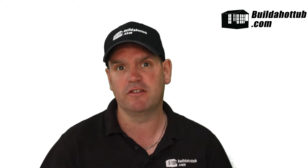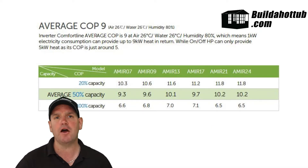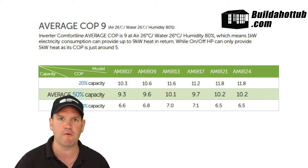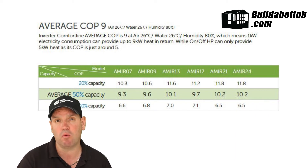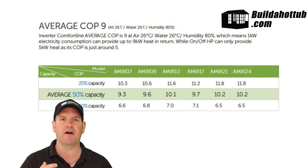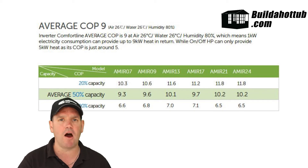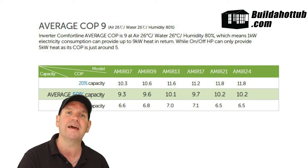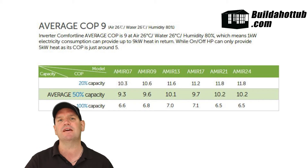So for me it wasn't a consideration because it's very rare that we actually get long periods of temperature below zero degrees where I am. Now for the money-saving bits, the COP — or the coefficient of performance — is basically the number that explains how much energy is required to go into the heat pump to deliver the amount of heating out. A COP of nine basically means that for every one kilowatt of electricity delivered into that heat pump, it will give you nine kilowatts of heating capacity on the other side.